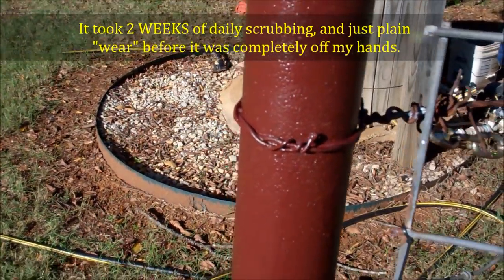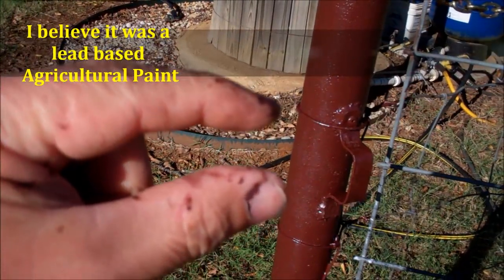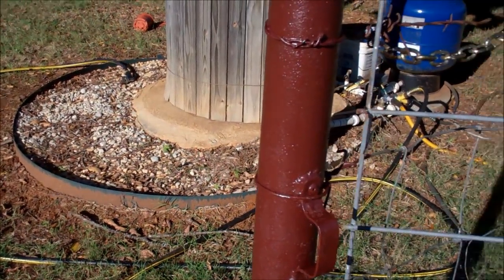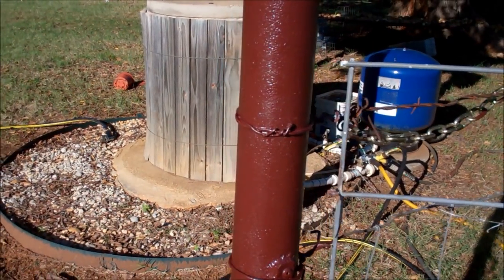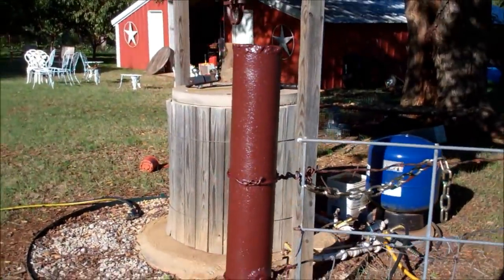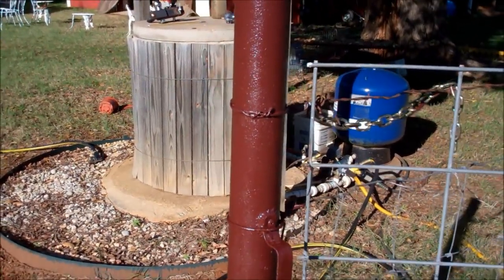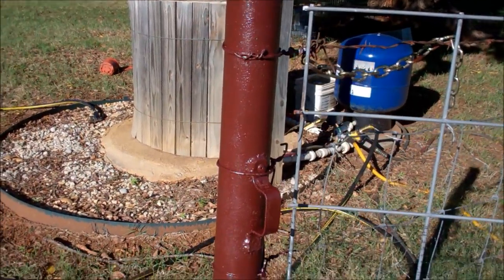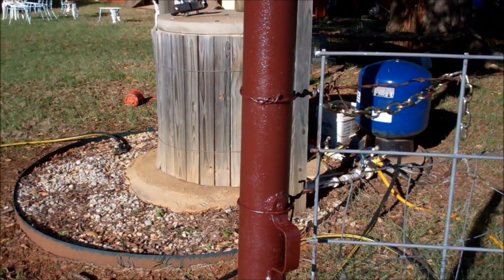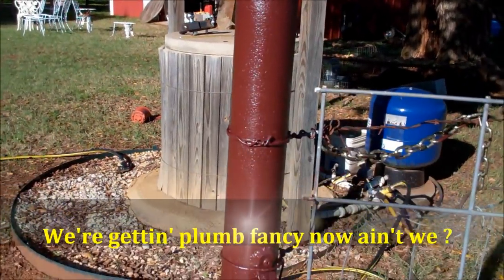Don't ask me what kind of paint it was because I've had it for probably 15 years. Opened it up, had a layer of skin on top that I had to skim off because it's been in the bucket so long. But anyway, here's the fence post — just shining in the sun. I like it. I've got me some new gates, and that'll be another video entirely. So if you want to paint some fences, I suggest a sponge, but I also suggest coating them first with a rust converter — a rust killer. The one I recommend would be Ospho. Thanks for watching.